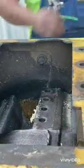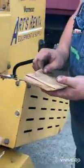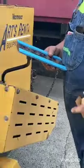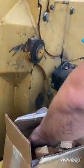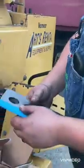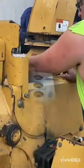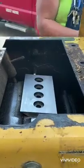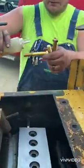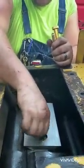Okay, that blade is out. Now this is a wood chipper kit from American Cutting Edge, and it includes the bolts and the blades. Correct. So you got everything you need to change your blades. It comes with the oil. Like I said, I just use regular 5W30, 10W30, whatever. And again, saturate them. Hand tighten them or hand start them.